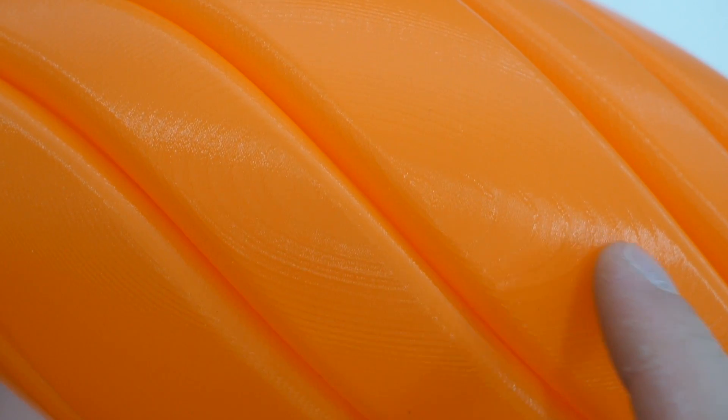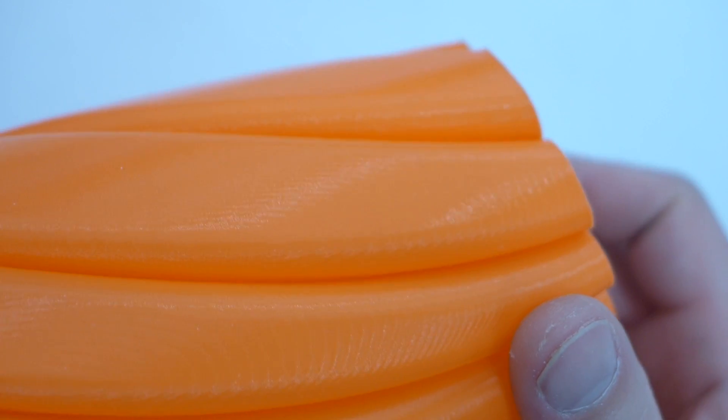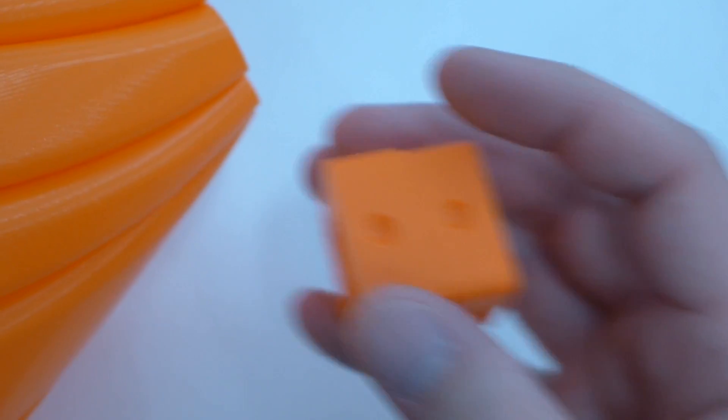The easiest way to see it is to look at the vase. There is the salmon skin right there. Here is the oval right here, and see how it perpetuates out and down the print? When you look at this, you're just like holy cow — you can really see that on a vase. You can see it goes up the whole way until it gets to another one right here, and it goes and goes until it gets to another one. So you can see there are issues with that. In vase mode I didn't have that shuttering I had on the cube — it's mainly just the way the salmon skin showed up.